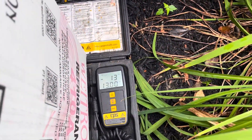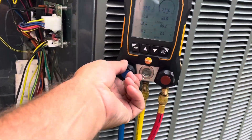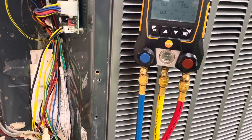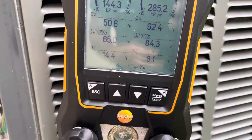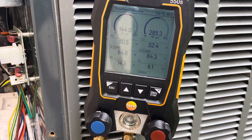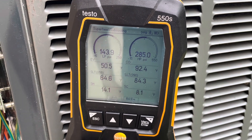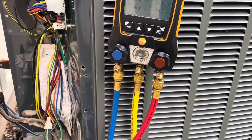We've got just over 13 pounds — well, almost 14 at this point. We're looking for 8 degrees of subcooling. We just cut off. It took 14 pounds 8 ounces total and we're right at 8 degrees of subcooling. I really wish this suction line temperature was a little lower — it might come down. 14 degrees of superheat is right in line. I like these readings — I like everything but that suction line temperature. I think it's running pretty good.